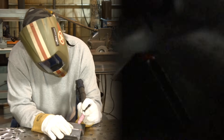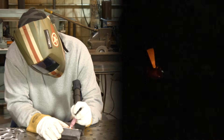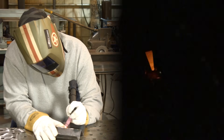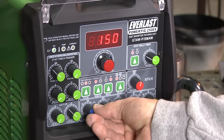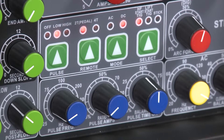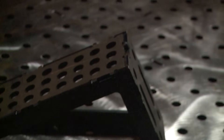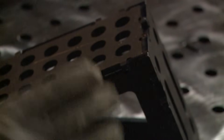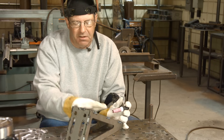I'm simulating the fit-up here using the spot timer, and I've got these outside corner joints where I just blasted this in here. I'll come back over the top of this in a minute and feature yet another adjustment on this machine, which is the straight pulse. I turned the pulse sequence on on top of the spot timer. I did increase the time to five seconds and increased the amperage to about 70 because this is quarter-inch to five-sixteenths thick laser-cut material — fixturing for the table. The reason I turned the spot on is I don't want to put a whole bunch of heat in here; I just want some flat tacks. I'm not one to go in and weld all of these slots and everything together — it's strong enough. I'm going to hit these tabs out here on the surface so I can go back and finish them off if I need to.